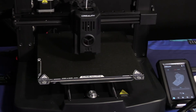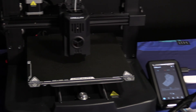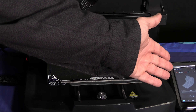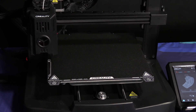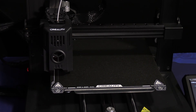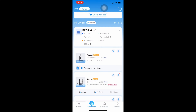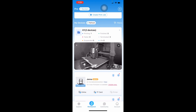With the Nebula pad connected, the Nebula camera pointing at the printer, and time lapse turned on in the Nebula tablet, this print should create a time lapse. Now that the print has started, you will be able to view the camera on the Creality Cloud app or website. Simply touch the camera icon. Should the camera be out of focus, you can adjust the ring on the front of the Nebula camera. If everything looks okay, just leave it be and walk away.